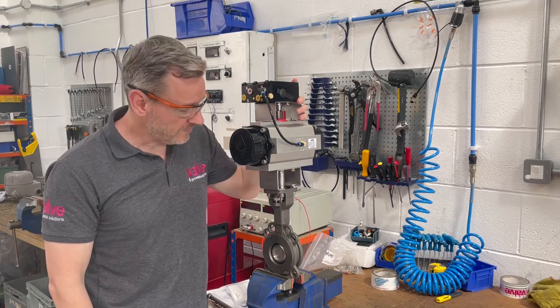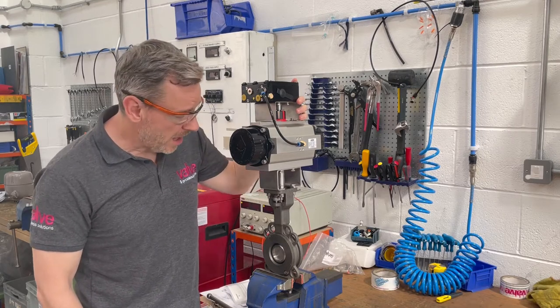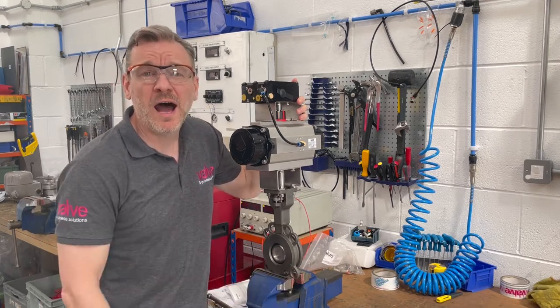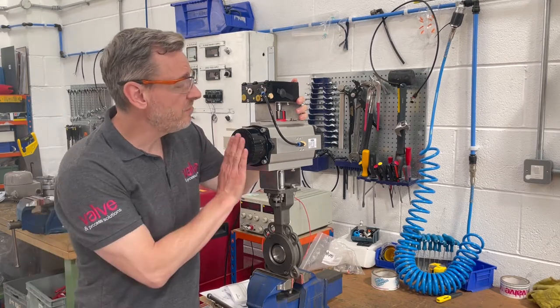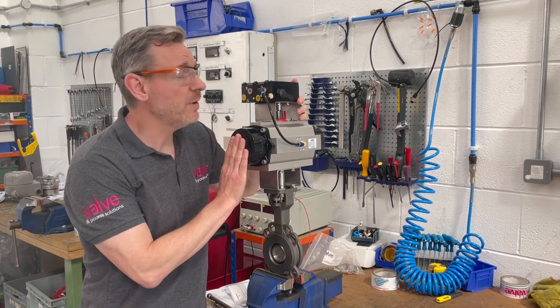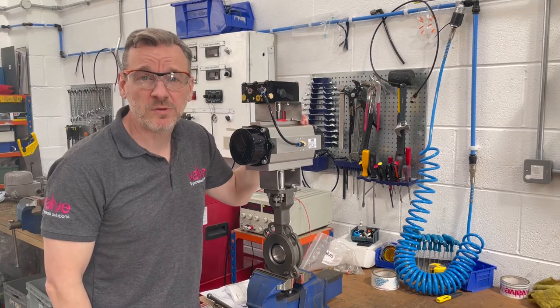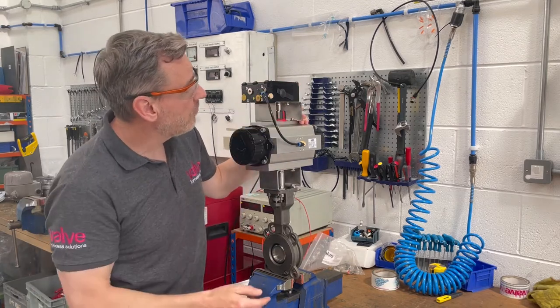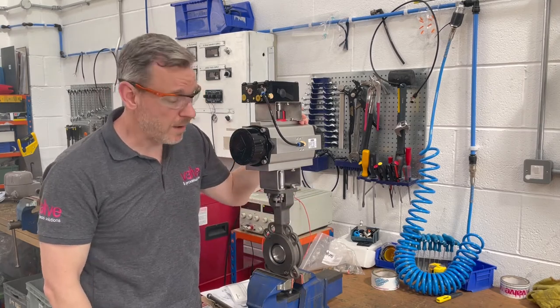Back in the workshop today, so just thought I'd do a quick behind the scenes video to show you something that we're working on. We've got some 65mm HiLok high performance butterfly valves from Emerson, which we're fitting with Actreg pneumatic spring return actuators. And then we've got the PMV P5 pneumatic positioner on there. We're piping down from the positioner with nylon tube and fittings as per the customer requirement.